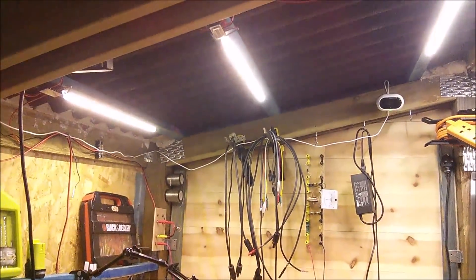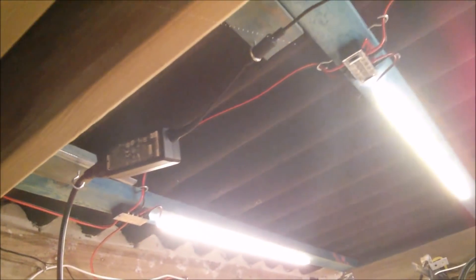So here I am in the workshop. Up there are the lights, and you can see here how I've connected them. You've got a pair of wires coming in — this is the in. You've got the commoning strips, which I've broken some of the forks away from. This one distributes pos across to there, that then goes to the light, and then there's a neg strip on the other side of the block.